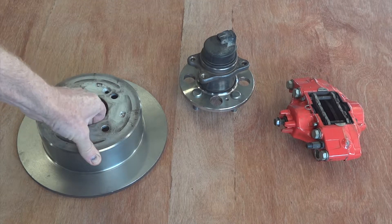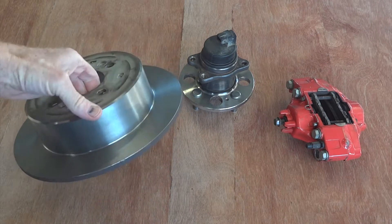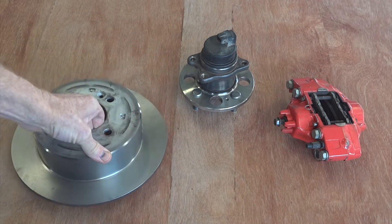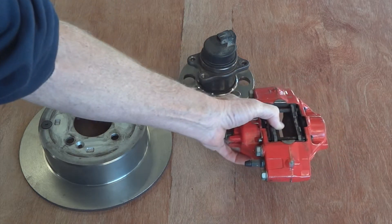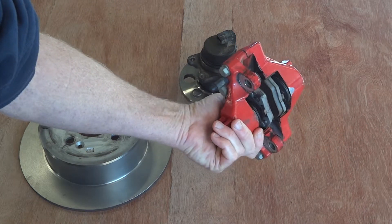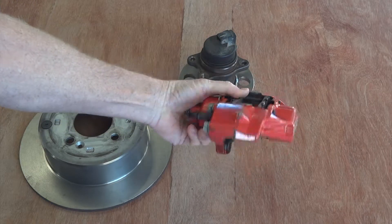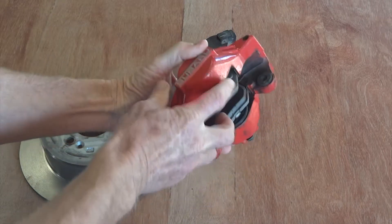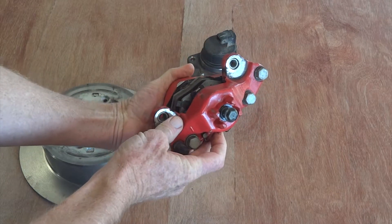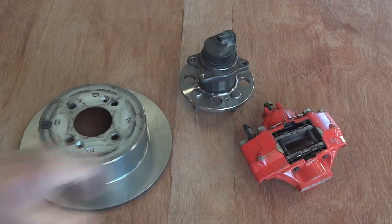With that goes a late 80s Nissan Pintara rear disc, which has had a bit of weight taken out of it. And a Subaru WRX rear brake caliper, which is a lovely aluminium thing — pretty much what you'd be putting on a racing car 10 years ago, but 100 bucks on eBay. Beautiful.